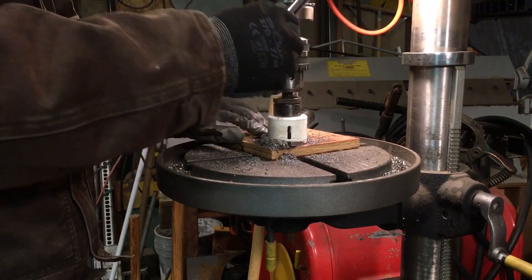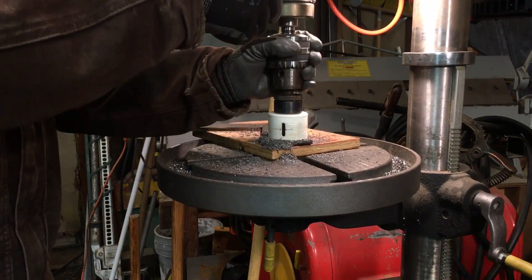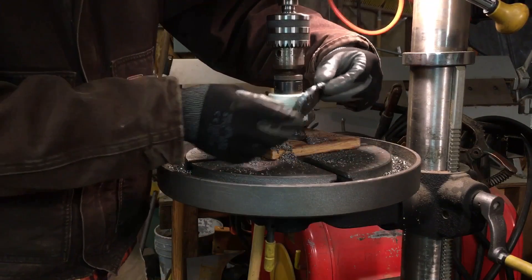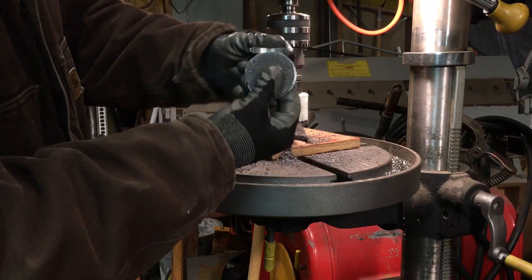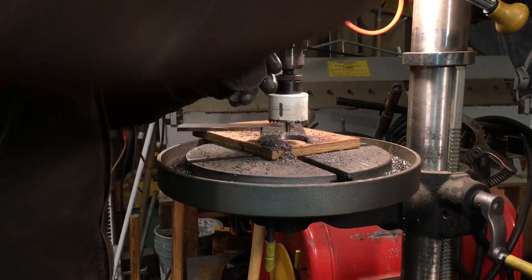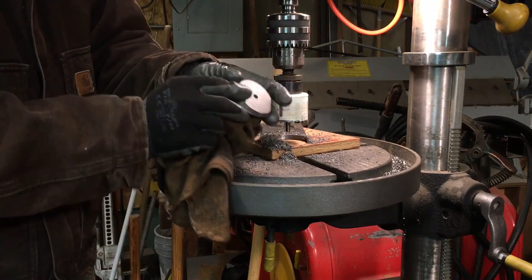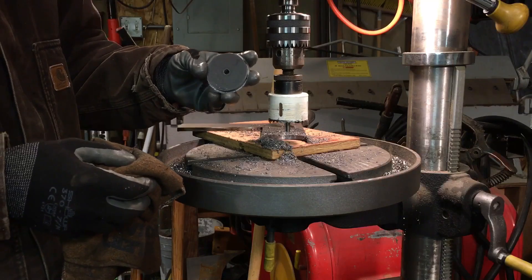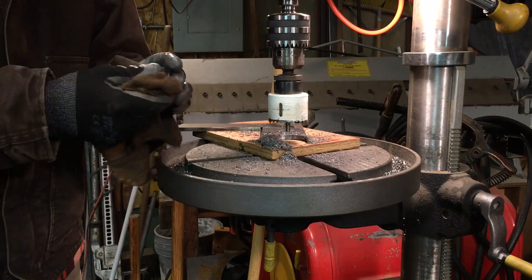So it started to break through and then it cut — because it didn't cut all the way completely. So I'm just going to back it up and try to work it out. Because I'm so close to the edge it broke through most places but not on this very corner here. So I'm going to go ahead and just break off this corner — that'll work okay for what I'm doing. Then I'll just clean this up with an angle grinder and a flap disc, clean off this burr around the edge and have my nice disc. I want that disc to go into this spring mount assembly for the log splitter — this is going to be the lower end of that inside assembly.